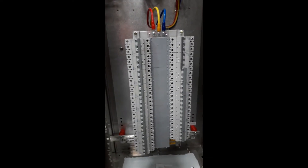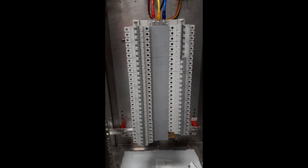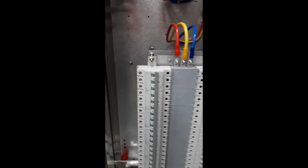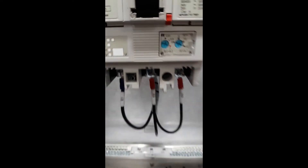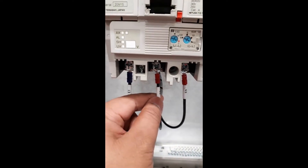This is branch breaker F13, and this contact is branded with C1. This is a branch breaker fed from F13 through a contactor board. These are the branches you can easily identify — this is C20. You will also find the incoming wires available in this area, branded E1 and E2, which are Line 1 and Line 2, and E3 for Line 3.